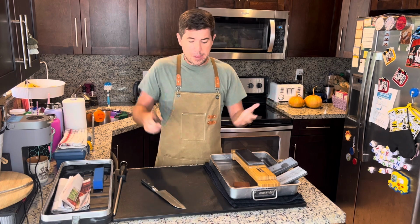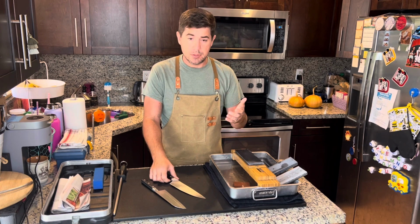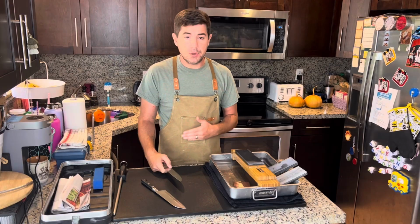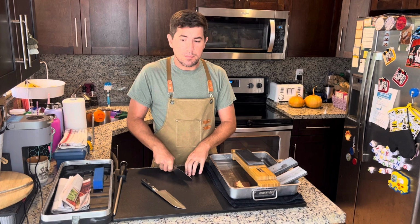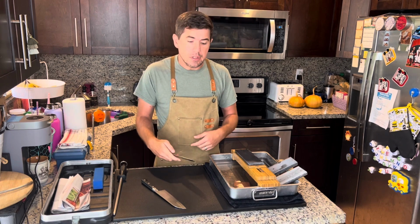What I mean by that is that the effect of dry sharpening is that you ruin the temper. You'll have a nice edge, but that edge will fade really quick. And like I said, when you ruin the temper, it makes your knife more vulnerable to getting dull a lot quicker. So you'll end up sharpening it quite often when you're not supposed to. You know what I mean?